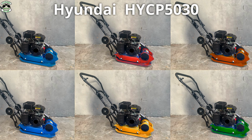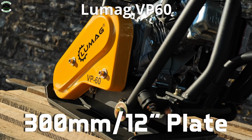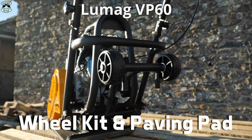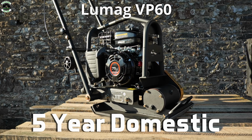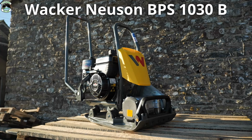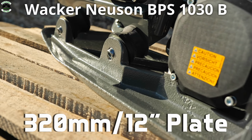manufacturers in different colours. Competing for the middle ground, we have the Lumag VP60 that has a 300mm 12-inch plate, a Lonsin 79cc engine, weighs 64 kilograms, comes as standard with a wheel kit and a paving pad, and comes with a 2-year commercial and 5-year domestic warranty. It cost us £575, including VAT.